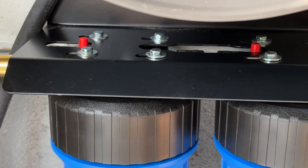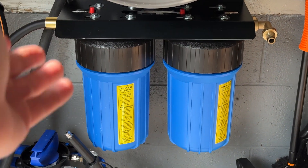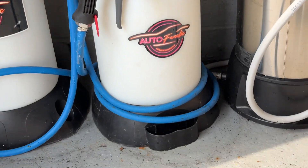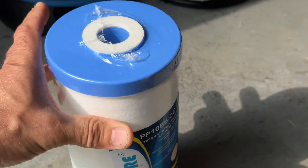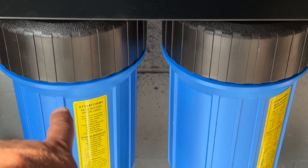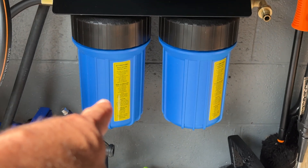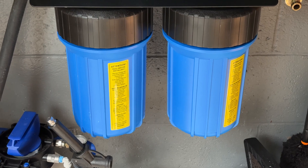Just to re-emphasize, this is exactly what I showed in the video a number of months back. The reason I'm doing this video is because so many people who went out and bought these systems or are considering them keep emailing me or posting comments asking how long the system lasts. I have two cartridges: this one is a carbon block cartridge — the PP10 BBCC 5-micron filter — and the cartridge on the right is a refillable resin bed. My TDS before installing this system was about 70 to 79, not really too high. They usually say anything above 100 is considered hard water.